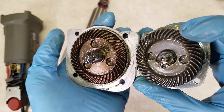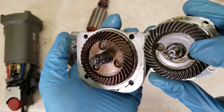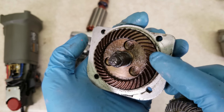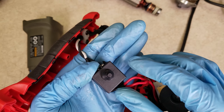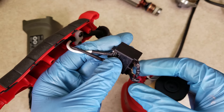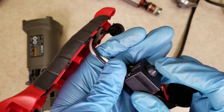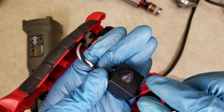If we take a close-up look at the crown gears, the quality and fineness of the machine work is just a little bit better on the new one — the face of the gear and the teeth are very well formed and cleanly cut. The old one is not bad, far from the worst we've seen, just not quite as nicely done. Neither of these use a name brand switch, but they share some details like heat shrink tubing leading up to the connectors. The new one is a heavier duty switch at 15 amps versus only 8 amps on the old one, and the new one also has a boot on the switch itself to help keep contamination out, while the old one uses a rubber o-ring.